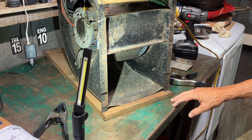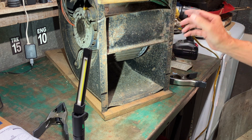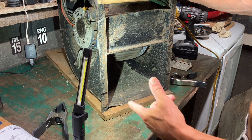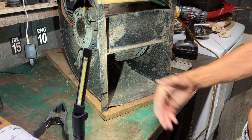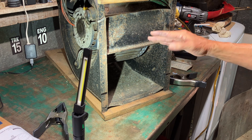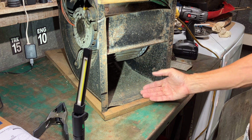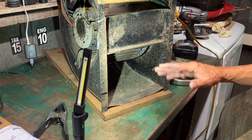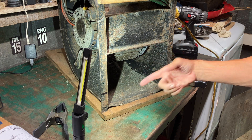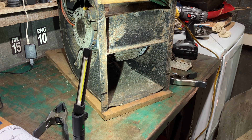The subject of the video I saw said that if you do something like this, you need to either restrict the airflow into the squirrel cage, into the blower, or restrict the discharge of the air. Because when this operates within the HVAC system, there is resistance that the airflow meets trying to force the air through the evaporator coils and through your duct system. If the motor is left to run wide open, it's going to draw too much amperage, overheat, and probably burn out over time.